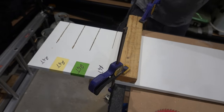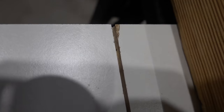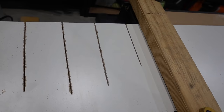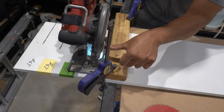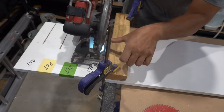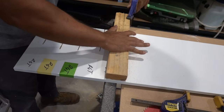There was a little bit of initial blowout at the start as I dropped down, but I'll show you what it looks like. You can see the first three jagged attempts compared to our first scored cut - I initially just clipped it a little, which shouldn't have happened. Now we'll readjust the depth a little bit deeper and cut through two more times until we've gone completely through the material, going directly over that exact same line each time, then drop it down once more to completely clear the material.